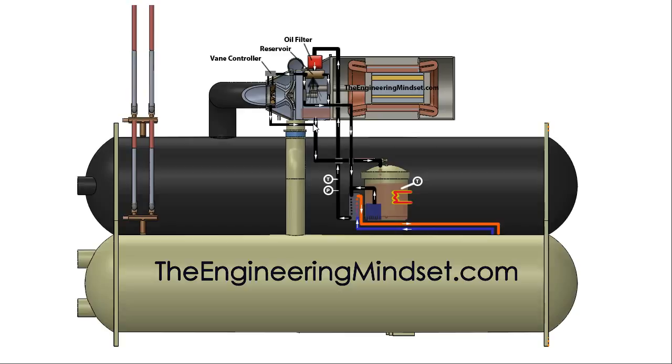This oil is then collected and joins back to the main reservoir, pushed back into the sump. As the oil is passed around, there is a chance that some refrigerant has entered it, so at the top of the sump there is also a vent. This allows any refrigerant that has made its way in to be vented back off into the compressor to complete the refrigeration cycle.